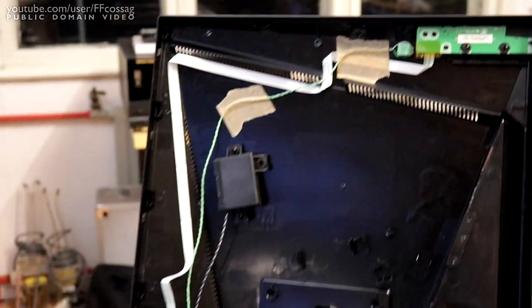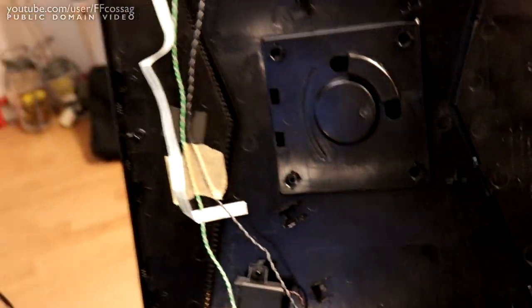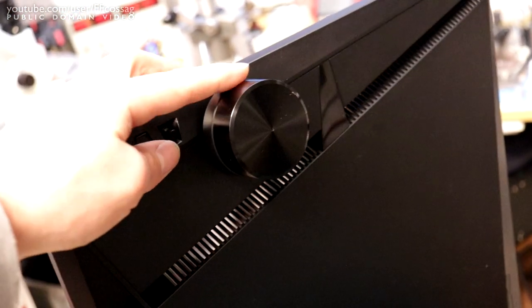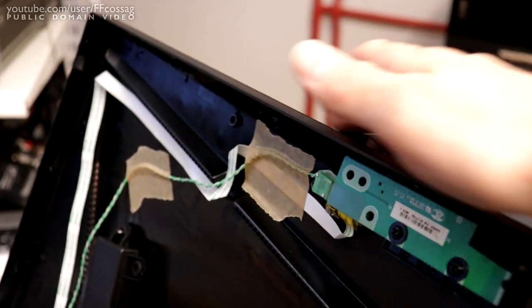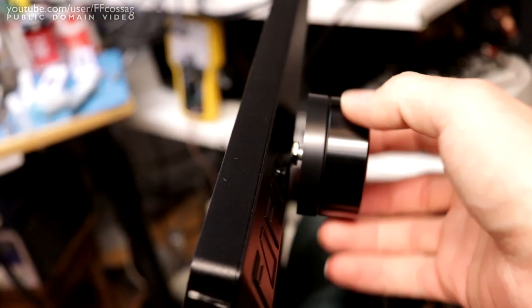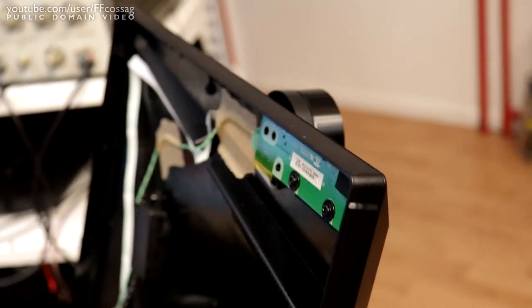And there is the potentiometer and its wiring. Just a bit of Cat 5 going to a female pin header, hanging loosely like all the other factory stuff in here. And on the back side, we have a volume knob from an Onkyo AV receiver, which is kind of the right size to be easily accessible. And it actually doesn't protrude from the side. I can't have it all the way down, flush against the shaft, when the potentiometer is too long, but that doesn't bother me. That's absolutely fine.